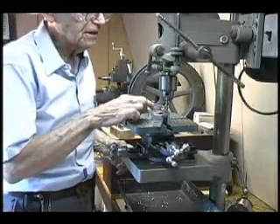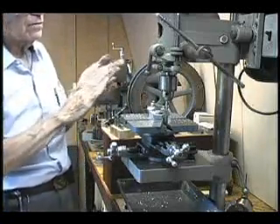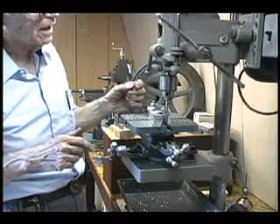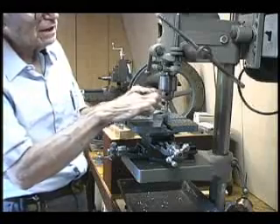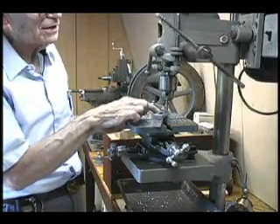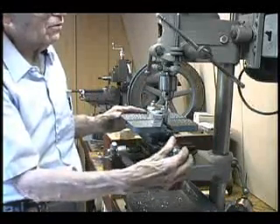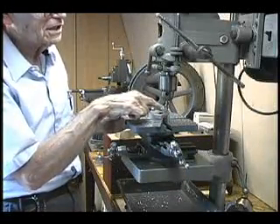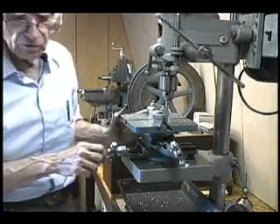You can see I've deepened that groove and you can see what a nice surface I'm getting. Whenever I advance the cut with a milling cut, I always advance it so that it's working against the direction of rotation. In other words, if I want to widen this groove on this side, I move the table in this direction whatever amount I want, and the cut will be taken on this side against the direction of rotation, which will widen that groove out.